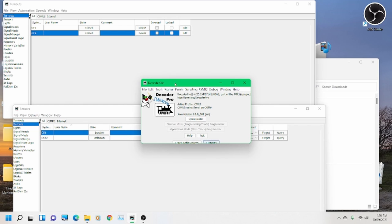Sorry for the delay. The next one will probably be on a 3 or 4 block signaling system. It'll be one direction, but simple enough to hook up for the second direction. And it'll use a single Arduino Nano for it, believe it or not. So we'll use CMRI and JMRI to do all the work and be kind of painless.